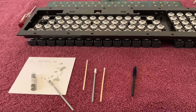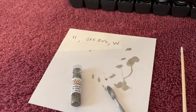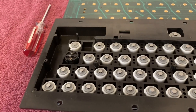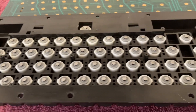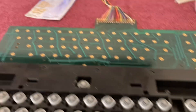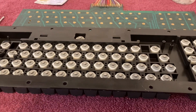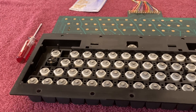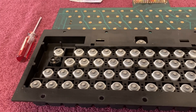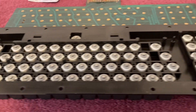It has been a little while and I've applied the conductive paint to all the keys. My note pad shows that quote, off/reverse, and W were the keys that were acting up, but I went ahead and did every single key. That way, hopefully I'll never need to take this circuit board off the back ever again, and the keyboard will work for another 30, 40 years. Initially I was just going to do the keys that were acting up, but after talking to Mr. Lurch and Adrian Black and a couple other friends — if you're going to work on a keyboard like this, just do them all and save yourself a bunch of headache.